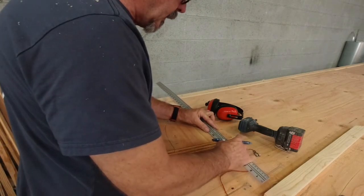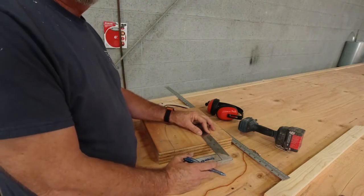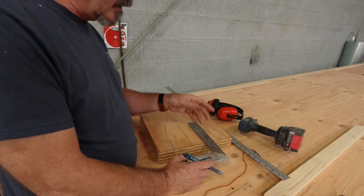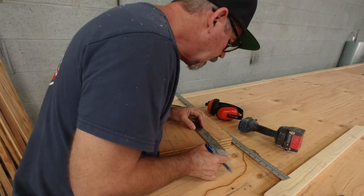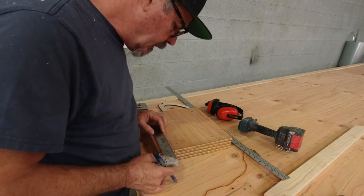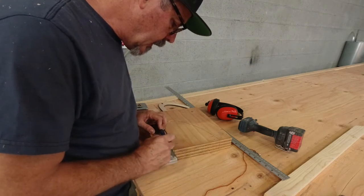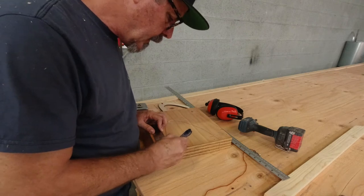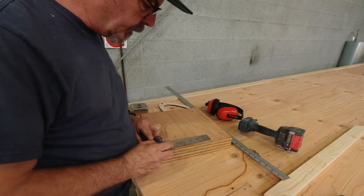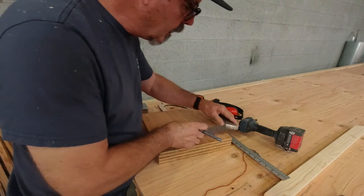So the spar is 3/4, and we have a 16th of an inch to account for the spar web, which is actually on the front side. So 3/4, actually it'd be spar web and then spar, but it doesn't matter as long as I get thirteen sixteenths, I'll be good. So we'll come over here and get 13/16. And then we'll start with that line. This is probably really confusing to you, but hopefully it's not so crazy. Seems organized in my head, and I hope it is in yours.